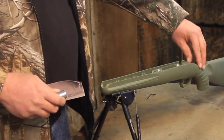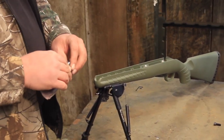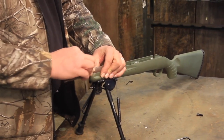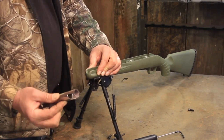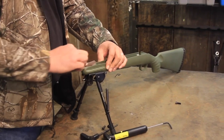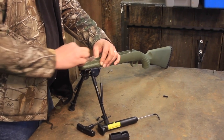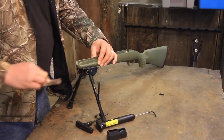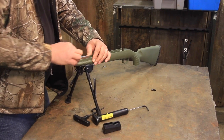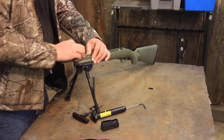I'm going to wrap the socket with some 120-grit emery paper, finish it up with some 400-grit, and then we're going to knock off the sharp flashing on all of the Ruger Americans — just like we did on our Ruger 300 Blackout and the Ruger American Ranch. I've wrapped the socket with sandpaper so I can get a uniform, even, round surface better than doing it by hand. We're just going to knock this down, then reassemble the action and make sure we are clear.